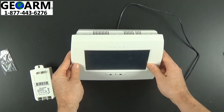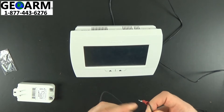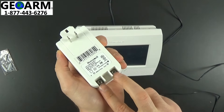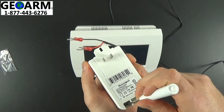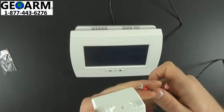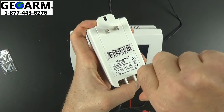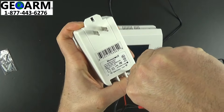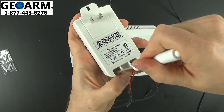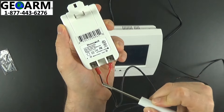Now that you have that all sealed up and the panel has been prepared, we're going to go ahead and prepare the transformer for the L7000 panel. On this panel, the L7000, there is polarity. So you need to make sure that the red wire and the black wire get placed into the correct areas. Go ahead and unscrew just a little bit of the transformer, opening up the screws. Locate the positive end, which will receive the red wire — go ahead and hook that in there and screw it down firmly so it doesn't come loose. Now on the negative end, take the black wire and go ahead and slide that under there and screw it in. Verify that red is into positive and black is into negative.